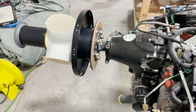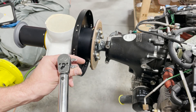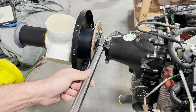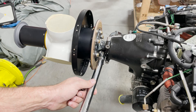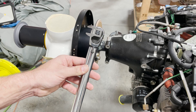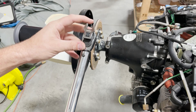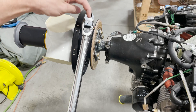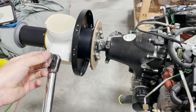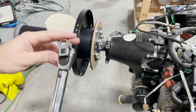A tip for this step: if you only have regular torque wrenches, you'll probably need to use a crow's foot to access the bolts with a socket, as some of these bolts are mostly inaccessible. If you use a crow's foot, make sure it's at a right angle from your torque wrench. If it's rotated straight out, you're effectively increasing the length of the moment arm and will over-torque your bolt. A right angle keeps the moment arm the same so your torque reading will be correct.